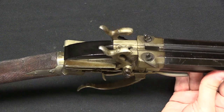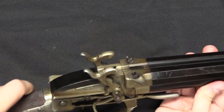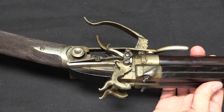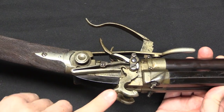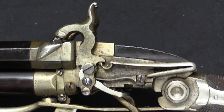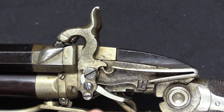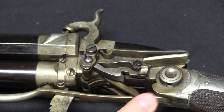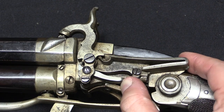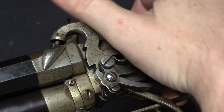The real funky bits are back here. We've got two hammers on the top and one particularly funky hammer on the bottom. All of this stuff is on the outside of the gun, which is kind of cool because it gives you a really good eye for how this all works. On the left side here, we've got a mainspring that actually powers the hammer, we've got some notches, we've got a sear, and we've got the actual trigger down there. What the trigger does is it simply pulls and pivots the sear on this centre screw. There's a little hook at the front that is going to lock into notches on the hammer.